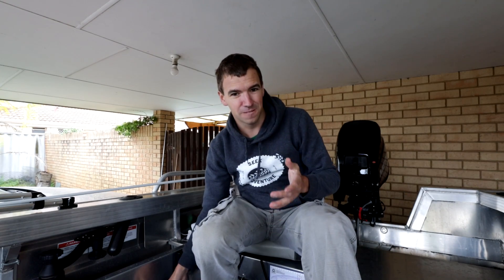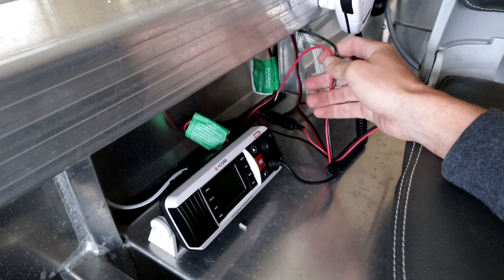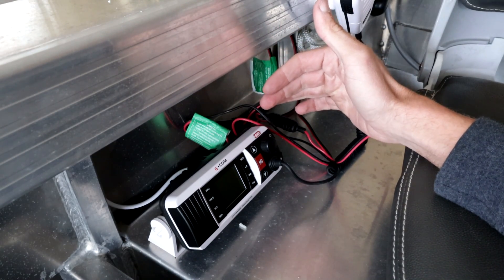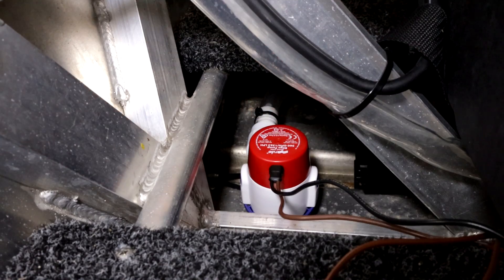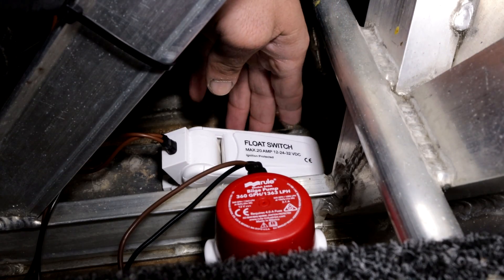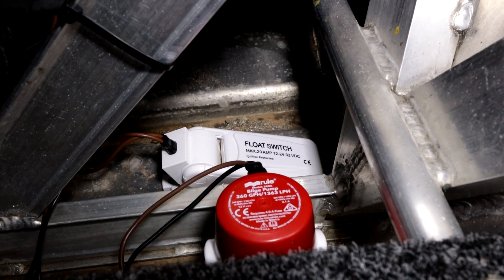What are we actually powering off it? One thing is this marine radio that needs to be hooked up — that's a safety requirement if you go more than five nautical miles away from shore. Also we have this 12 volt bilge pump here that needs to be hooked up. That's just siliconed down to the floor, wires are all ready to go. The bilge pump is either going to be activated by the float switch automatically or by the switch manually on that junction box.